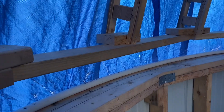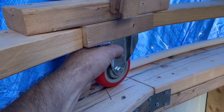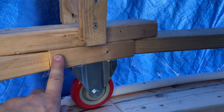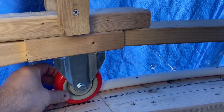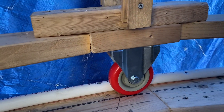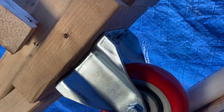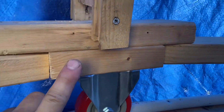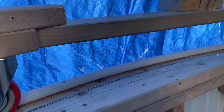This has a little bit of flexibility going in and out — not so much anymore, I had to fix that. I also needed to make it so that I could adjust the position of the casters without getting underneath and trying to screw. It was very awkward. So I screwed it into this block, which I then screwed from the top, and then I could bring it in and out.